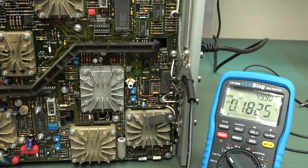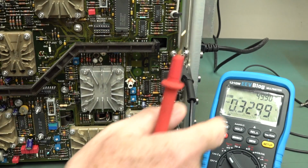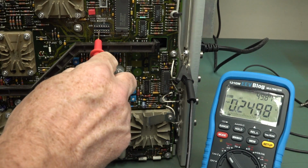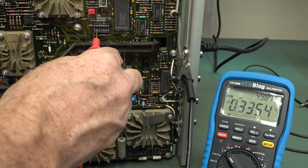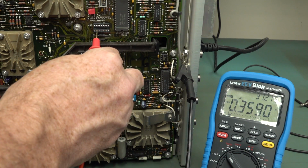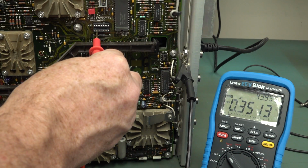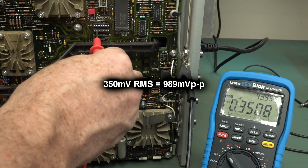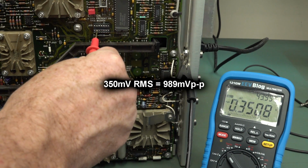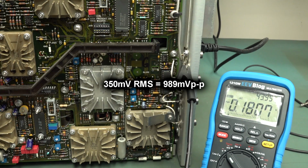Is that the RAM? So I'm just going to measure the ripple on the 5-volt digital, because that's all we care about at the moment. So I'll whack it on AC pin 2. The spec is 150 millivolts peak-to-peak ripple, and we're getting 350 millivolts. So our 5-volt rail has a lot of ripple on it. That would explain a bit.